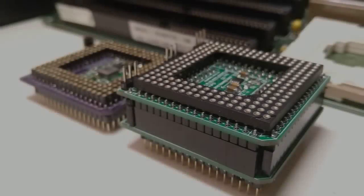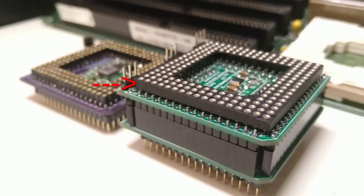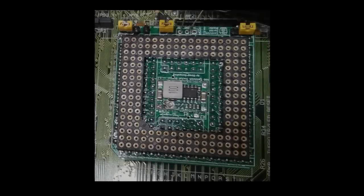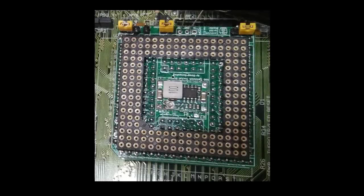This design allows us to use an actual 168 pin PGA socket instead of the single row receptacles that had to be used in the old design. Please note that the new board will only accept the small size mini buck converters that are 18 mm by 12 mm because of lack of space.